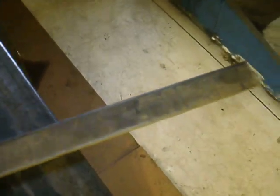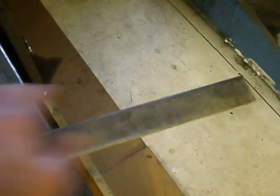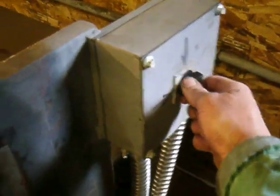Virtually no burr whatsoever on it with your fingers. Let me shut this off cause it's a little loud. Took a while to get the two knives set as far as clearance — ended up going with about eight thousandths clearance between the two blades, so it's pretty tight.